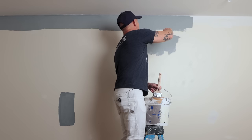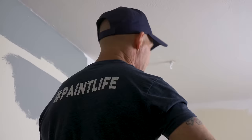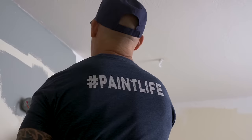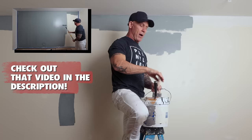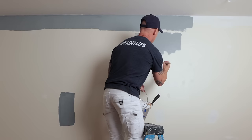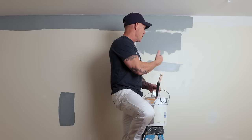What causes the halo is the stippling from the roller — it's a different texture than the brush stroke, which leaves what we call roping. That's a difference. You're going to see not just a color difference but haloing due to texture inconsistencies. Now if I go back and back roll my cut-in, I can bring it within a quarter inch of the ceiling. Now you only have a tiny stripe that's brush strokes. I'm going to smooth this out, then I'm cutting in and I'll come back and back brush it — that lays out the paint in one direction.